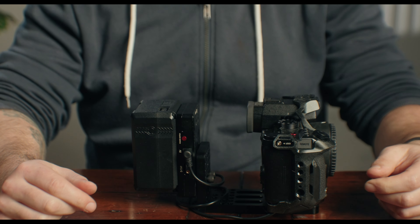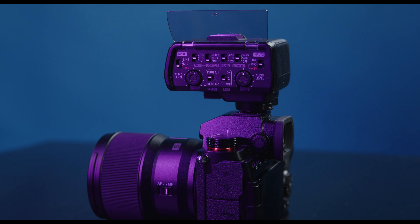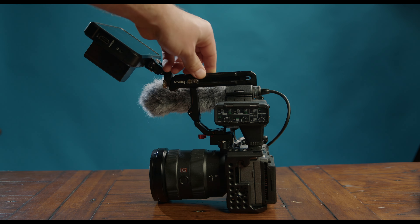The biggest problem with a mirrorless camera setup like this is audio — you don't have XLR jacks going straight into the camera. The Panasonic, Sony, and Canon all have XLR hot shoe options, but they all have the same problem: once you put the XLR adapter on the hot shoe, the adapter gets in the way of the rest of the rig. The other issue is, unless you've got the GH7 and the new XLR adapter from Panasonic, all of these other hot shoe adapters don't have 32-bit float recording. 32-bit float allows you to recover audio recorded too loudly or too quietly in post-production, which is incredibly useful when recording audio in situations where it's going to fluctuate greatly. Recording in 32-bit float is the ultimate audio insurance policy, so rather than look for an XLR hot shoe to put on, we're going to buy the Zoom F3.